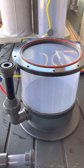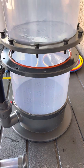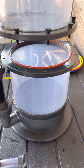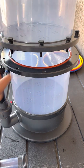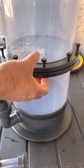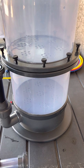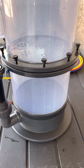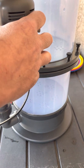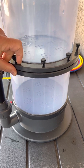On top of that we're going to add the main chamber, which is right here. You're going to notice these screws here — this end is not threaded, this end is threaded. We want to be real careful not to strip those threads out. If you do, it's not a giant problem — you can just put a nice stainless screw all the way through with a nylon lock washer, all stainless on the other side. These screws are clocked so they're only going to want to go on one way.